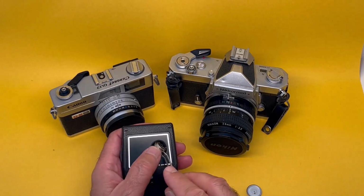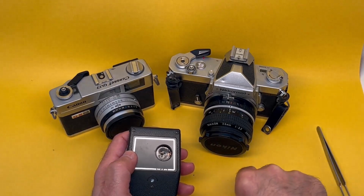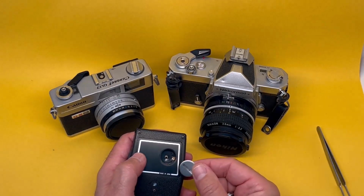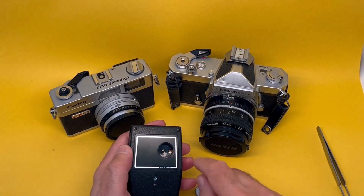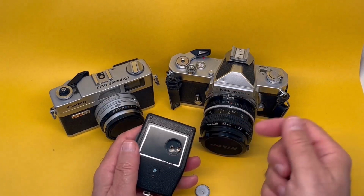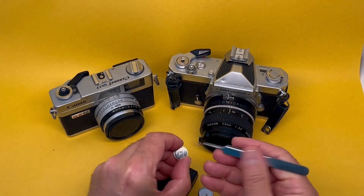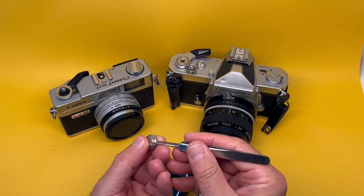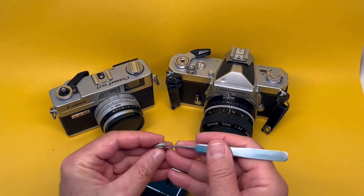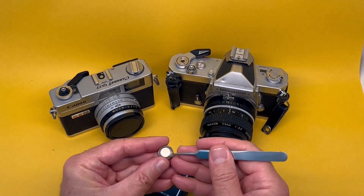And if you remove it, you find that there's a housing. And sometimes the lid is part of the electrical connection and sometimes it isn't. The housing can vary considerably between devices, cameras, light meters, many other things. Now the important thing is that these batteries of course have two sides, a positive side and a negative side. The perimeter is part of the positive side. The negative side is only the middle bit here.